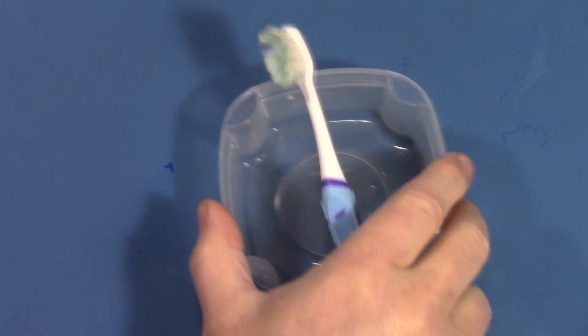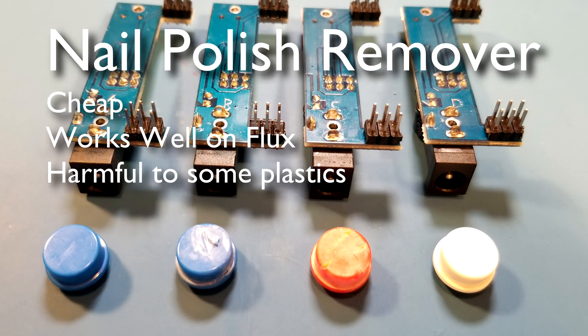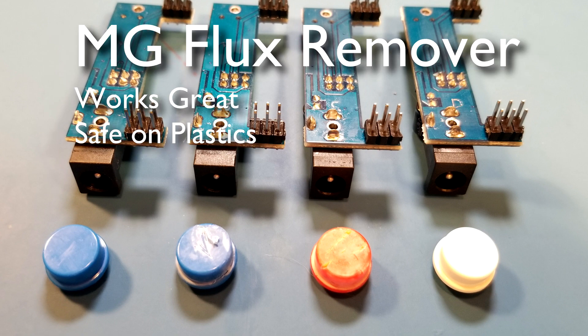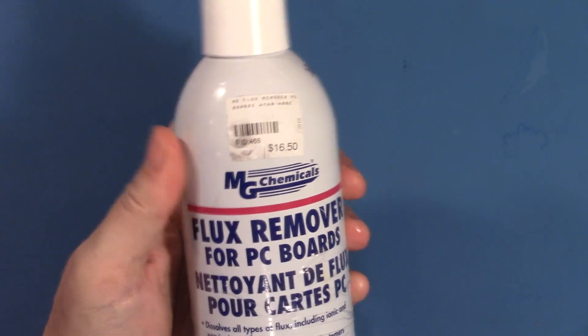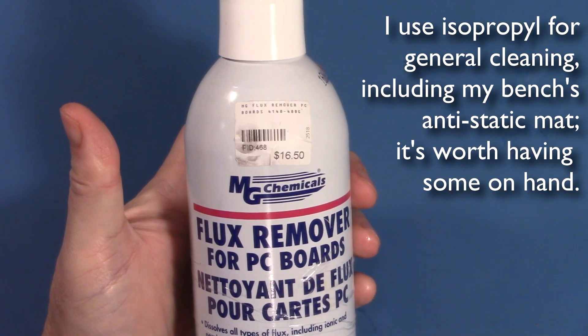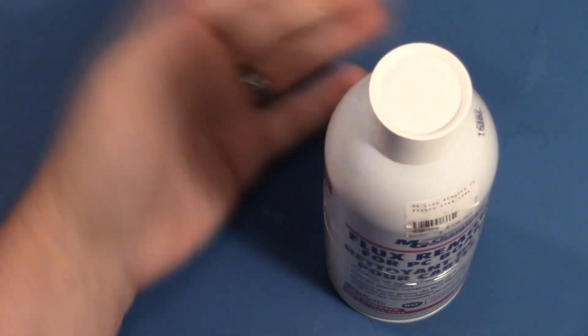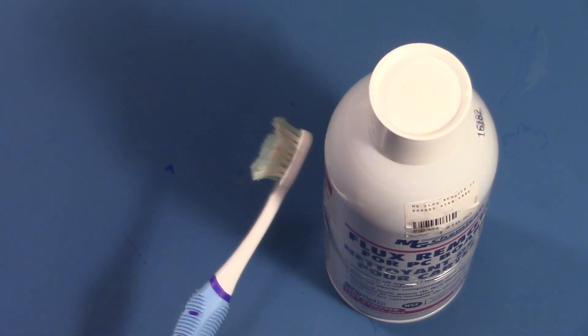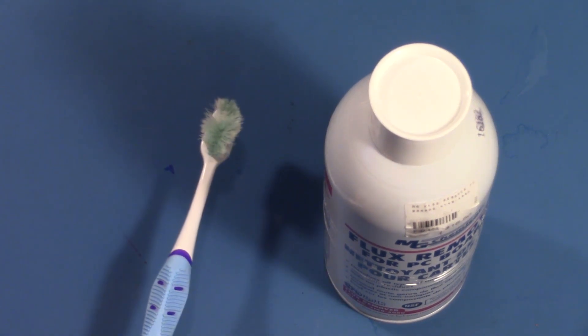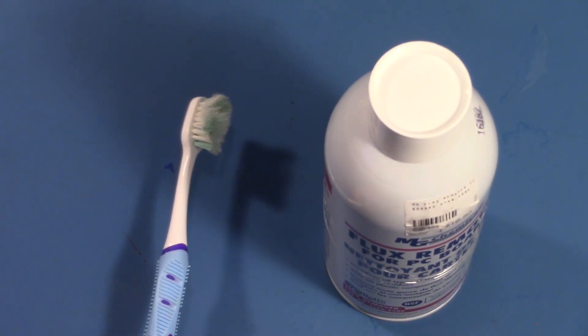So in conclusion, what would I use? Isopropyl alcohol is cheap and it works well. Oddly, of the two nail polish removers, the acetone one was less harmful. And the commercial flux remover is perfect. So the winner here is to buy the real thing — flux remover. In a pinch, if you don't have it, I would recommend using isopropyl alcohol. It might be a little more work, but it'll do the job. And the tool of choice here is an old soft toothbrush — toothbrushes are your friend. Thanks for watching, and if you like this video give it a thumbs up, or subscribe to my channel and there'll be more in the future.